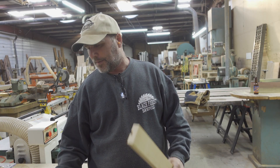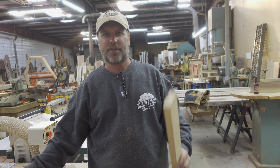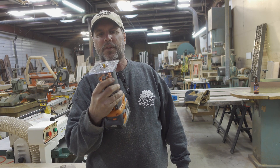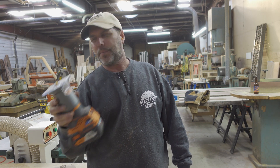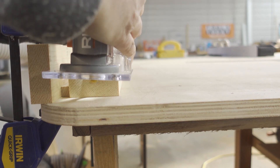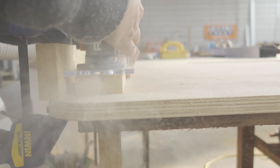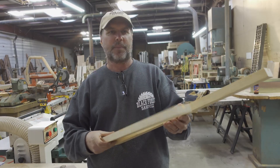This is the Microjig Dovetail Clamp, and what I did was simply take the router bit that comes with them — it's a quarter inch by half inch dovetail bit — and put it in my cordless router. Set up a fence and ripped the dovetail all the way through this piece of ponderosa pine, then did the same thing with this piece.